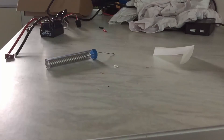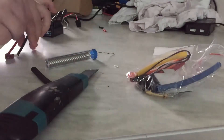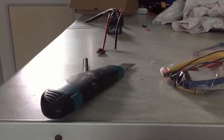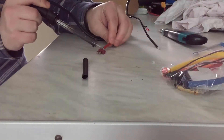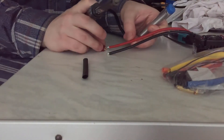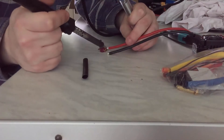It's been a little bit tricky. In the first video I said it's going to be pretty easy, but one of the main problems I had is with my motor mount itself, mounting it to the axle. It comes with three grub screws that you use to pinch against the axle once you put the mount on, and that holds it to the axle. One of my problems was the grub screws were not pinching correctly. I went with JB Weld, which is basically an epoxy metal resin — epoxy resin with metal fibers inside, metal dust. When it's hard it sets solid and you can drill into it. It did start cracking under vibration, but I put some normal epoxy over that and with it being a rubbery material, it's held the crack together and is working fine.